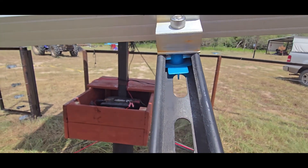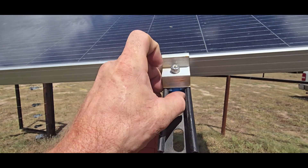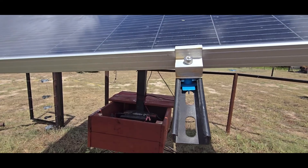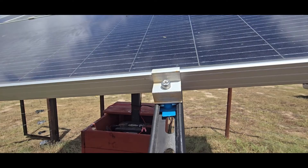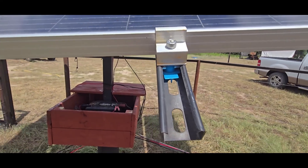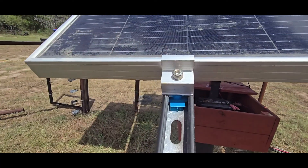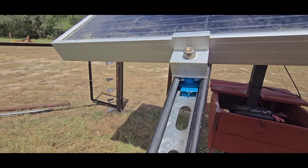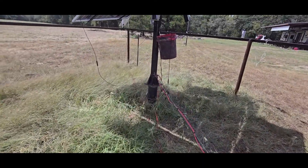When you get these pieces, they have a washer in there, and on mine all of those were installed upside down. I spent about an hour on this — I even watched videos on how to mount them, and the videos were wrong too. If someone in those videos actually tightened the screws they were showing, those parts would have popped right out because the washers were upside down. If you're installing one of these and getting frustrated, that could be your problem.